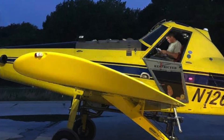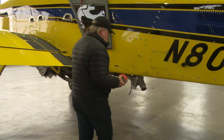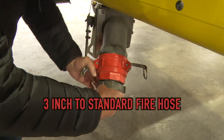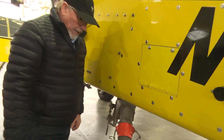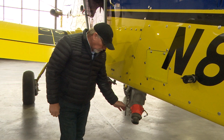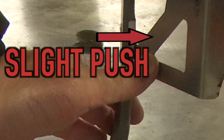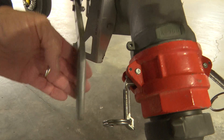Always keep an eye on the pilot. When he motions for you to come in, you can approach with the fitting on your hose. Walk up and connect using this three-inch cam lock — snap it onto the fitting there. Once you have that on the airplane, take your thumb and push the stainless steel over and pull this lever up.